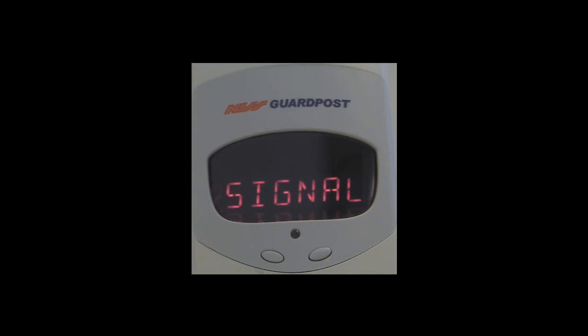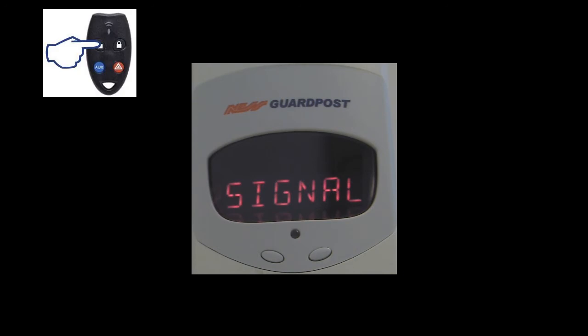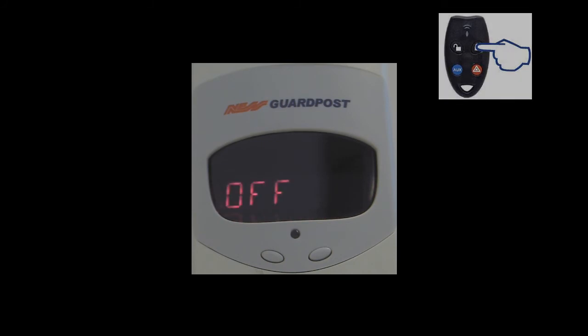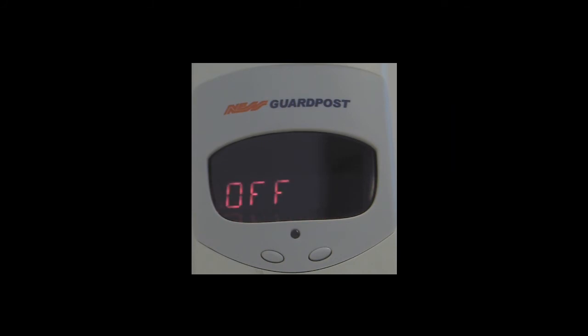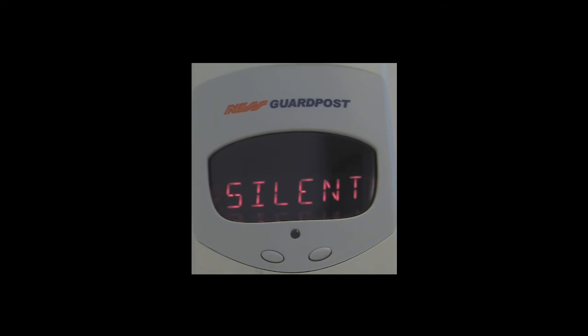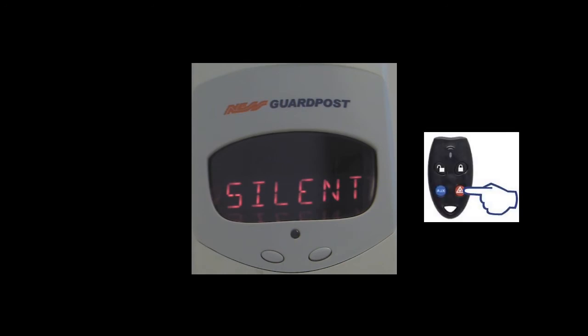Pressing the off button on the radio key takes us to the next option, which is radio jam, or radio jamming alarm. When the radio jamming alarm feature is enabled, it will generate a chime in the disarmed, home, or home 2 modes if it receives a continuous source of radio interference. If the SG3 is armed, the system will go into full alarm. Pressing the on button will cycle through the sub-options: off means it is disabled, on means it is enabled and you will get chimes and alarm, or silent means it will still be active but will only report through to the control room. Select the option you wish, push and hold the panic button to save your setting.